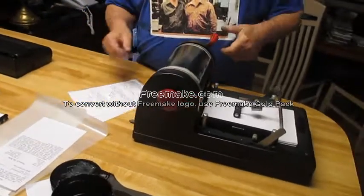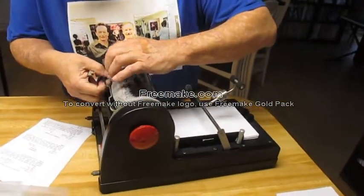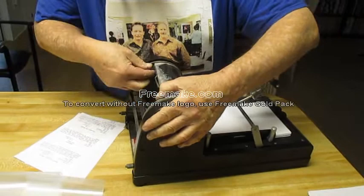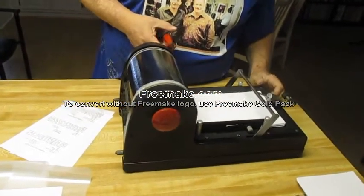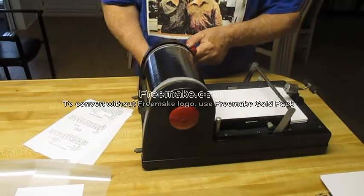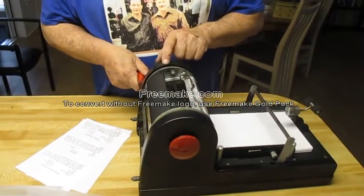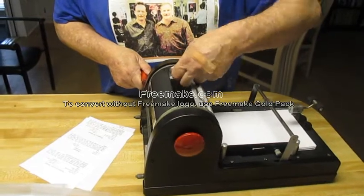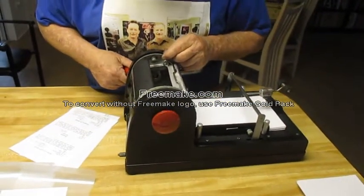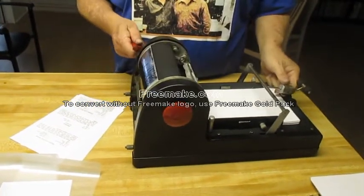Way too low. But first of all, the stencil is done so we'll seal it. The copy is low, so I'm going to show you that you release the impression lever because you don't want to get ink on it. Turn it back and right here this knob will lower or raise — it says L or R. It's on the lowest part of L right now. Just turn it and the drum moves, so we want to raise it a good half inch. I'm going to put it more to the center, a little more off the center, more to the raise part on the right side.